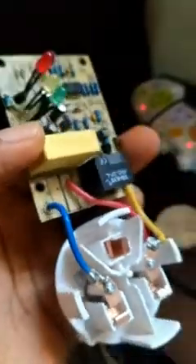Let me plug it in so you can see what I'm talking about. As you can see, it's plugged in now — the circuit is on. I'm testing here: there's no supply at this output point, but there is supply at the input. When the relay switches it passes current here, but here is the input current. There is supply here, which means the whole thing is working — the relay is sending supply to this place — but there's no supply at this output point to complete the circuit.